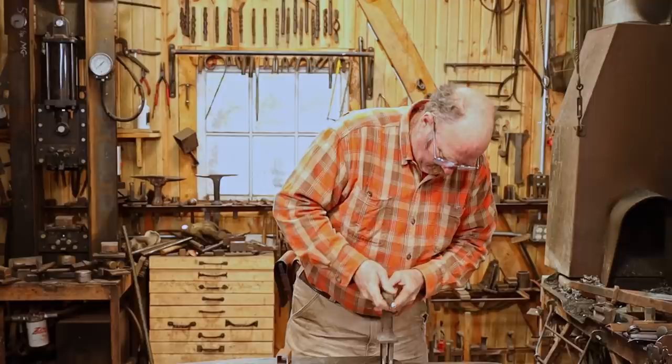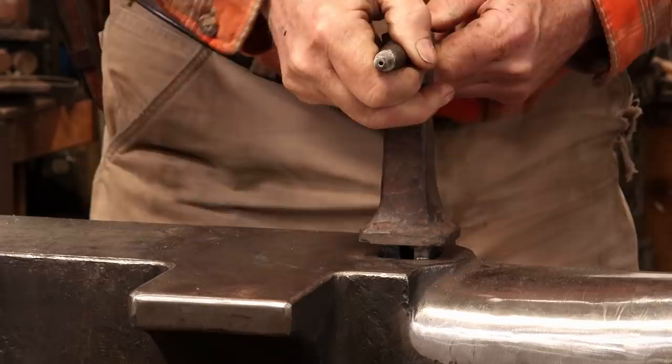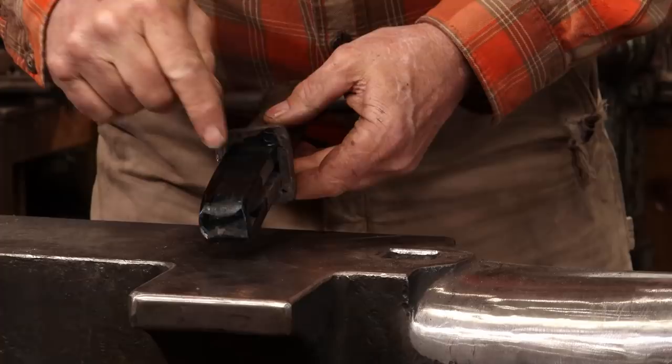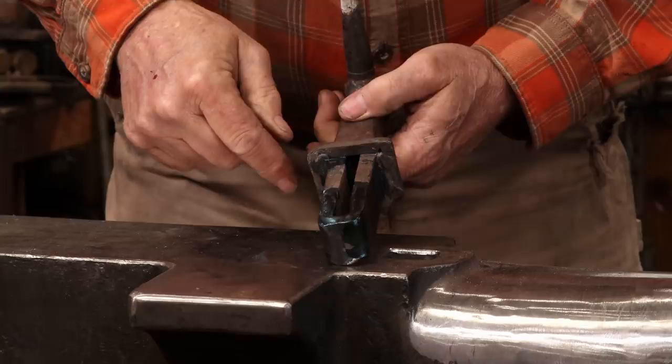I'm going to put that in and out of the hole at all sides even though I don't have to make it fit every direction. It goes down but it doesn't come out very easily. That should tell me right there — just a few little scratch marks right down there and right around in there. So I'm going to go clean those up — a few little shiny spots up here.